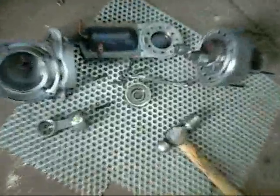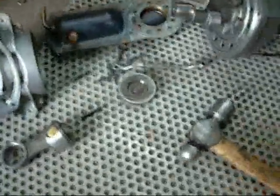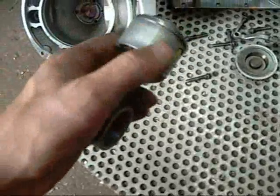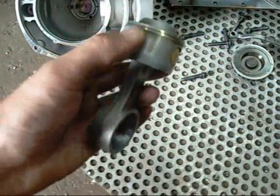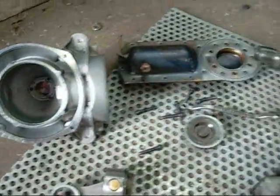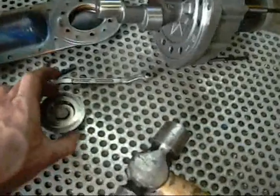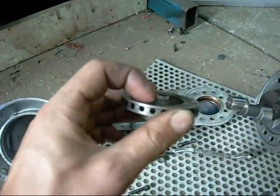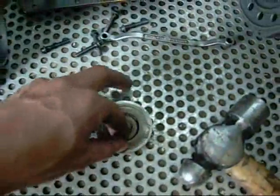The conclusion of this autopsy is bad reed valves. The piston and ring are fine. This compressor's run quite a few hours — there's definitely a lot of wear on the skirt and everything, and the oil's used. It's not a new compressor that was built faulty to begin with, but the suction reed valve is warped. Either that or it was installed upside down.